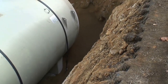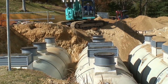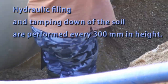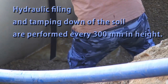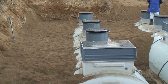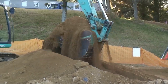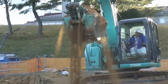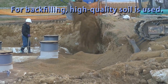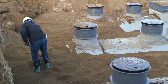The space around the JOKASO is then evenly backfilled with soil to prevent tilting, deformation and damage. During backfilling, hydraulic filling and soil tamping are performed every 300 mm in height. Measures are taken to prevent soil and sand from entering manhole covers, the inlet and outlet pipes and joints. For backfilling, high-quality soil and sand that do not contain pebbles are used, as pebbles may cause damage to the JOKASO.